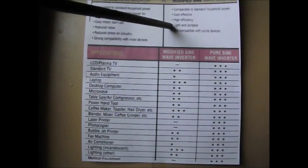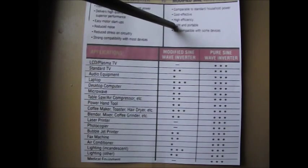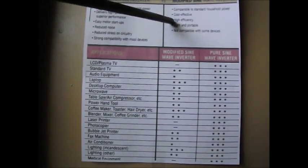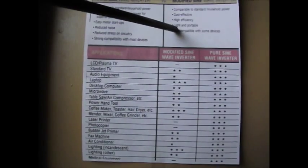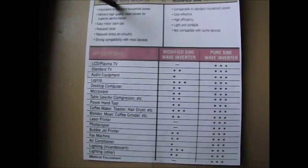Your little transformers — where one end plugs into the wall and the other end plugs into whatever device — that little transformer may heat up quite hot, because the modified sine wave is going to create that. It's not flowing the same as pure sine wave, so it's working harder to produce the same result.